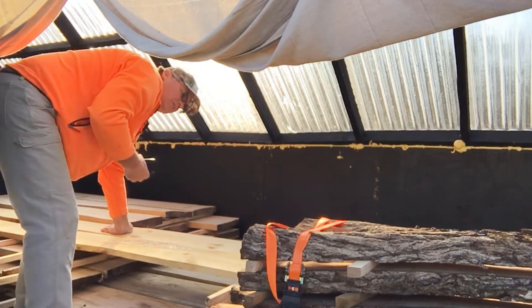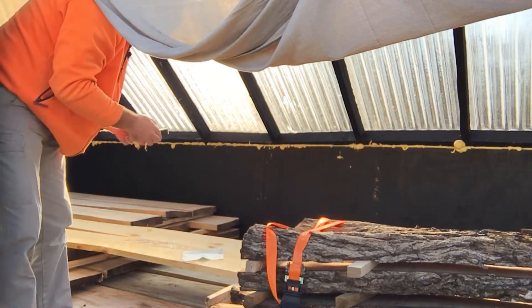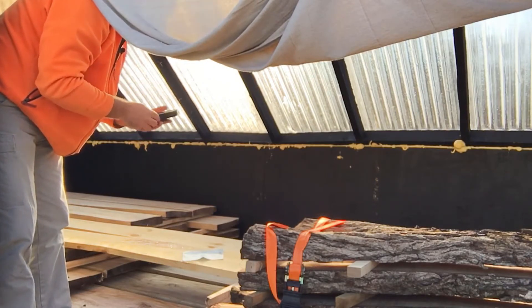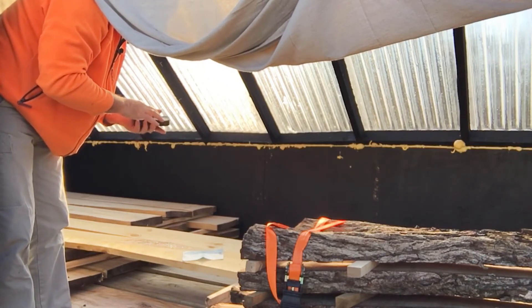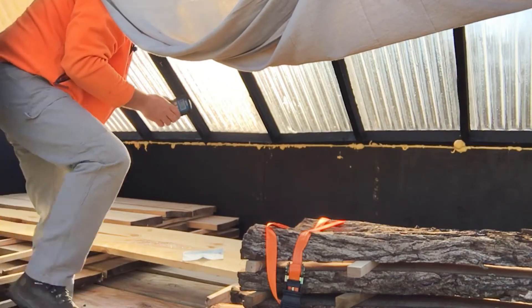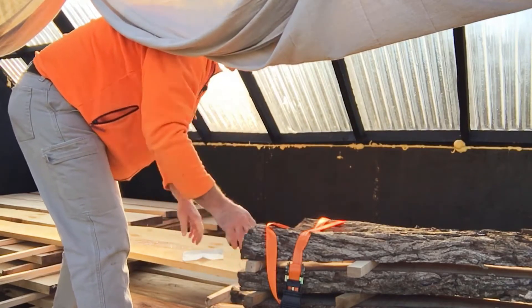For the walnut, we'll change the species setting to 0.55. There's sawdust on everything. We'll hit on-hold — that's 19 percent. That's 6.6 in this crotch piece right here, which looks like about a three-inch slab.